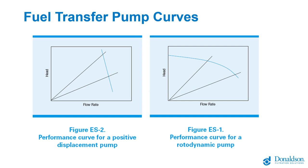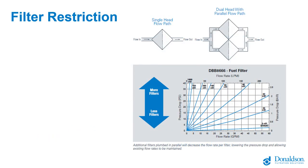Contrast that with a rotodynamic or centrifugal pump — more of a high-volume transfer pump. As you can see on the graph, if you add just a modest amount of restriction, you back way up the pump curve. Adding as little as five or six pounds of additional pressure drop can cut flow rate in half. That can be a significant issue for filter service life — the customer doesn't want flow to drop dramatically, and you'll be changing filters with very little life on them. We highly recommend switching to a gear pump or a vane pump — something positive displacement — for better filter life and performance.